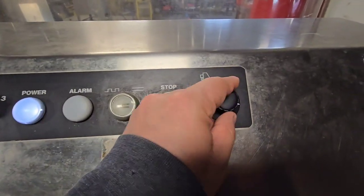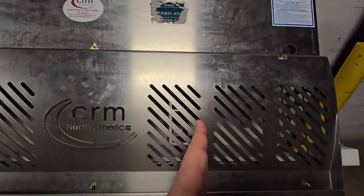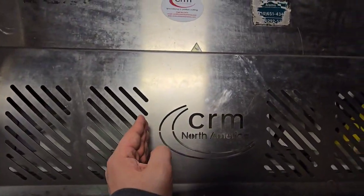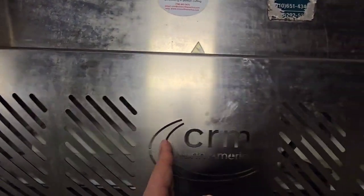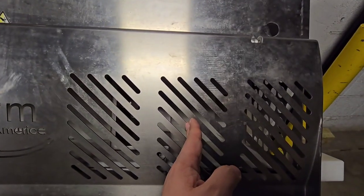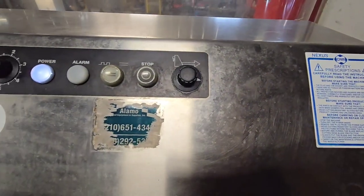Stop button of course, and then this denotes where the gripper goes back to. So if you're putting in a shorter piece of product you can turn this knob here to the left and have your gripper end here, or if you're doing a longer product you can get your gripper to come back further. Right now we've got it set to about what I'll refer to as three o'clock.